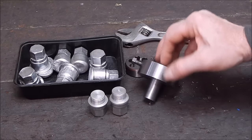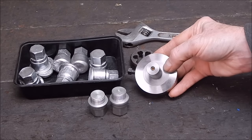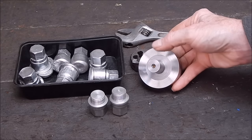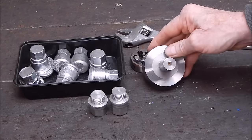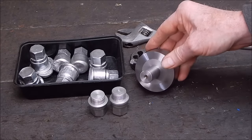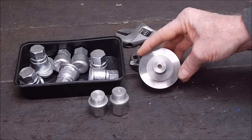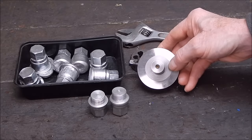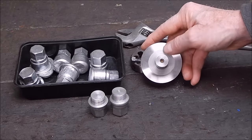It is interesting looking at this scrap steel to show you how you never know exactly what you're getting. This was supposed to be mild steel, but that's not mild steel. I'm pretty sure this is steel for making truck axles - you can see the composition is a lot harder on the outside, far harder than the centre. It machined OK, I could tap a thread in it OK. But when you buy steel from junk yards you don't know what you're getting. I've got about six lengths of big round stock out there, probably a quarter of a tonne, and every bit I've cut and machined has been different - some are soft, some are hard as hell. In this case I'm pretty sure it's axle steel. They do it that way so the axle will flex a bit and not break - they have a double composition.